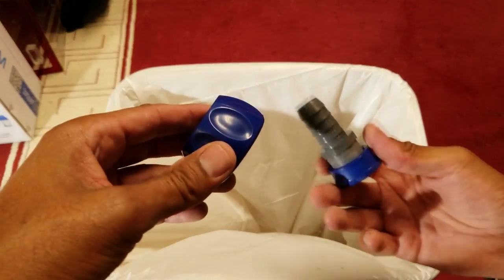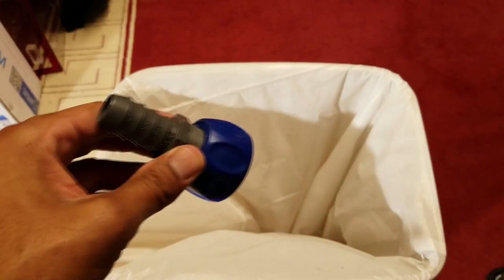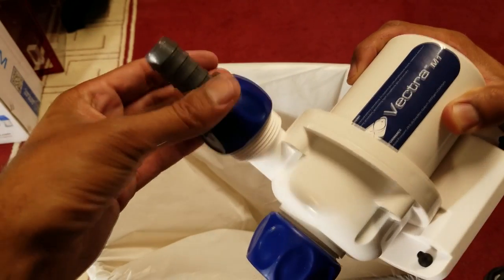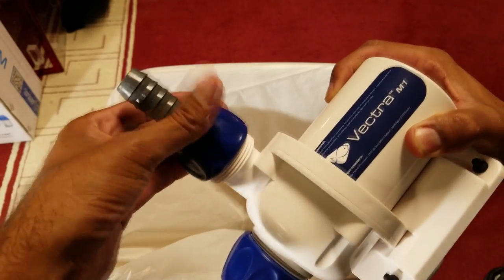The other issue is that the fittings are said to be compression fittings, meaning that you only need to be able to simply push the 3/4 inch PVC into the coupling, place the collar on, and screw in without using any glue.